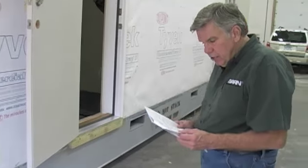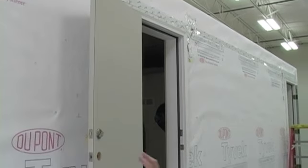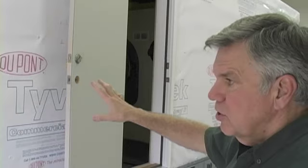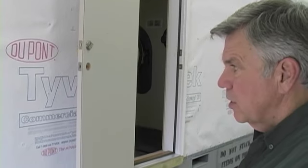Third thing is you're going to have to install roof trusses. Now, the units right now do not have the tarp on top, which will be put on for shipping for additional water protection. And there's also going to be some lath on the side. You need to remove the lath and remove the tarp before you install the roof trusses and plywood.